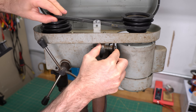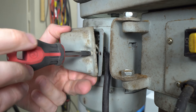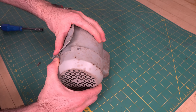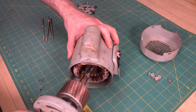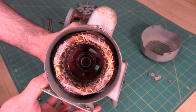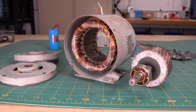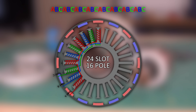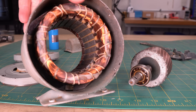To find out, I had to open it up and take a closer look at the stator. This stator has 24 slots, which is exactly what I was hoping for. Because 24 is divisible by 3, I can rewind it as a 3-phase motor. My plan is to convert this into a 24-slot, 16-pole brushless DC motor, and this is the winding diagram I'll be using. The diagram shows an outrunner motor, but the winding layout is the same for inrunners like this one.